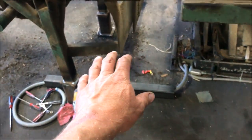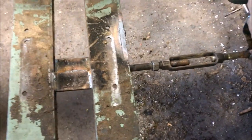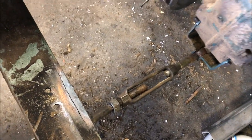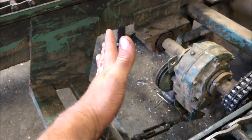Of course, the wiring, everything down here, the conduit stuff, the flex is all messed up. The torque arm on this gearbox is all messed up. We got that straightened out. Oh, it's a tad bit wallycocked. Motor was wallycocked. The pulleys was running like this, you know, and running on one belt. So we're putting the second belt back on.